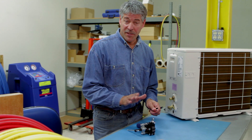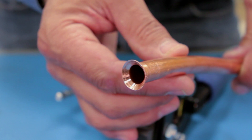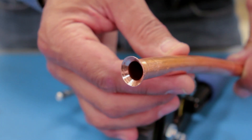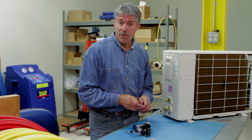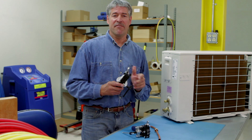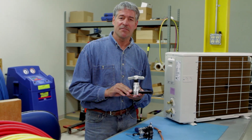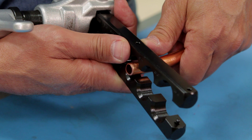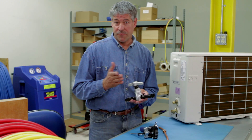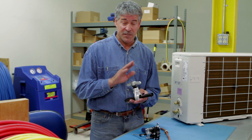When you're done, the flare will fit like a glove. And this larger diameter flare fits in all flare nuts, so you can use this tool for the other refrigerants you regularly work with as well. Many mini-split manufacturers recommend the use of an eccentric cone flaring tool. If you use this tool, however, you must compensate for the height of the tubing, so look for guidance from the manufacturer for setting the height.